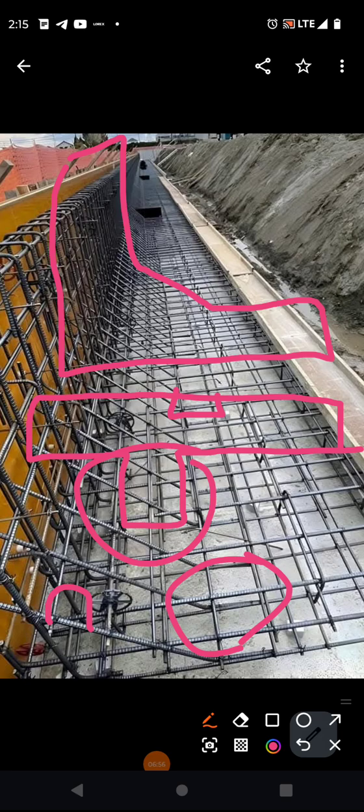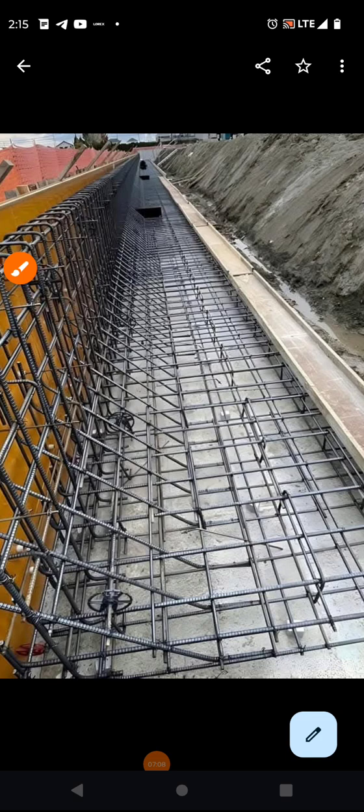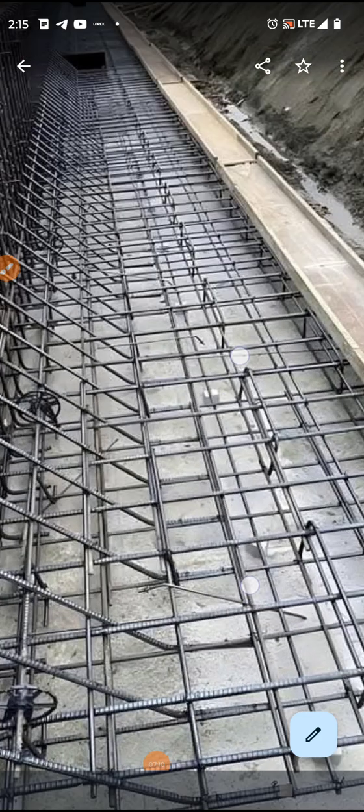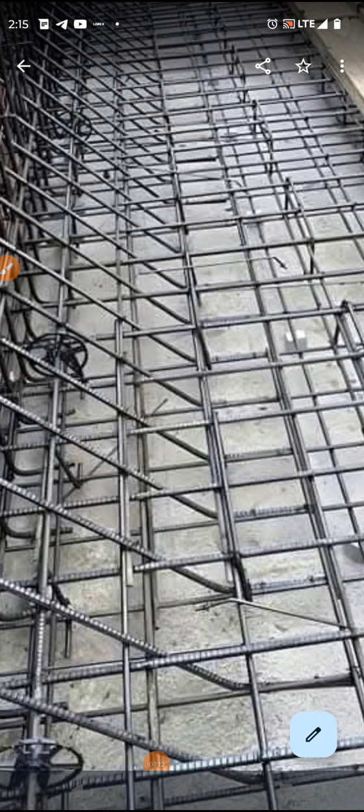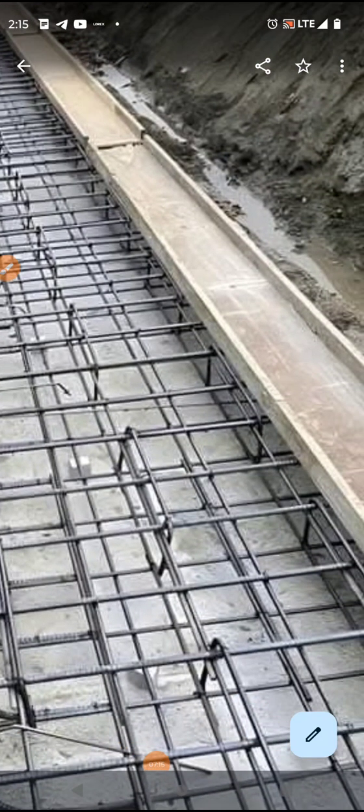So this whole top section can just slide on the pad. I don't care if they keywayed the bottom or not into the soil. They still can just slide off. It defeats the purpose. If this was keyway down there, it's still useless. You don't see any keyway of this whole top pad surface. Nowhere do you see it drilled into the concrete either, epoxy, doweled, etc.